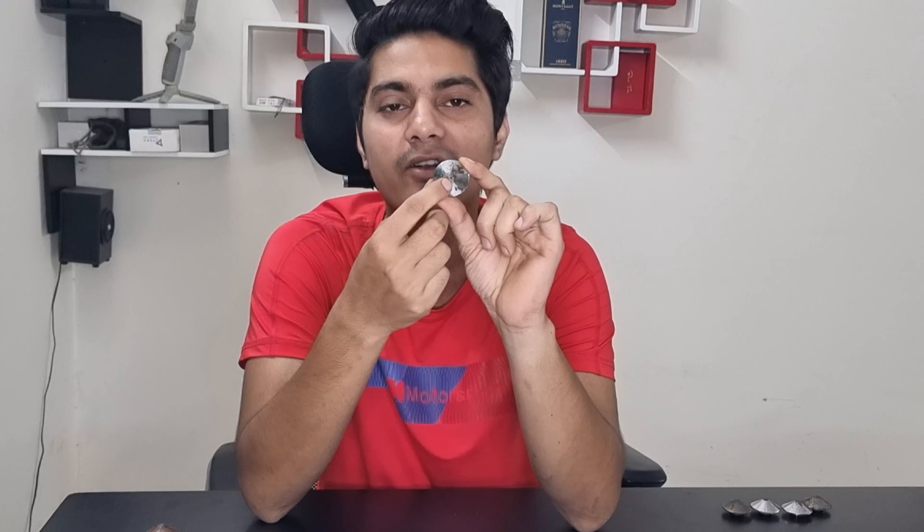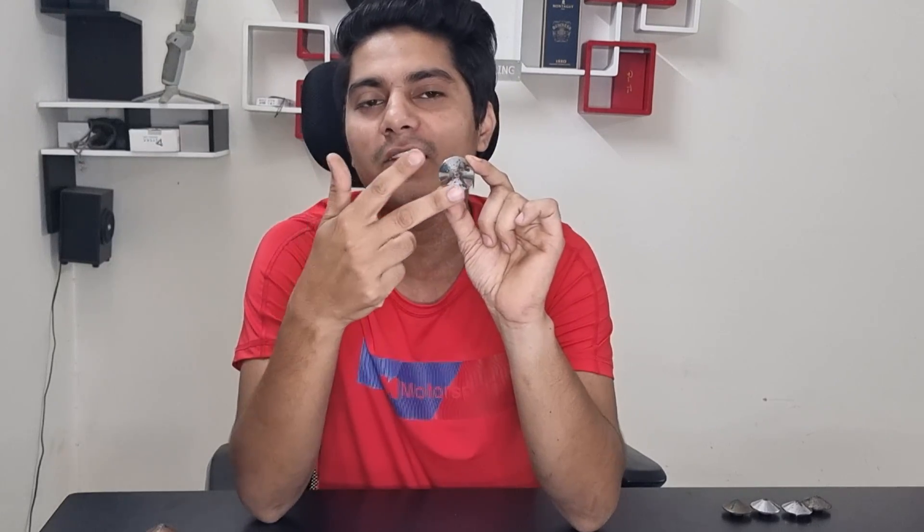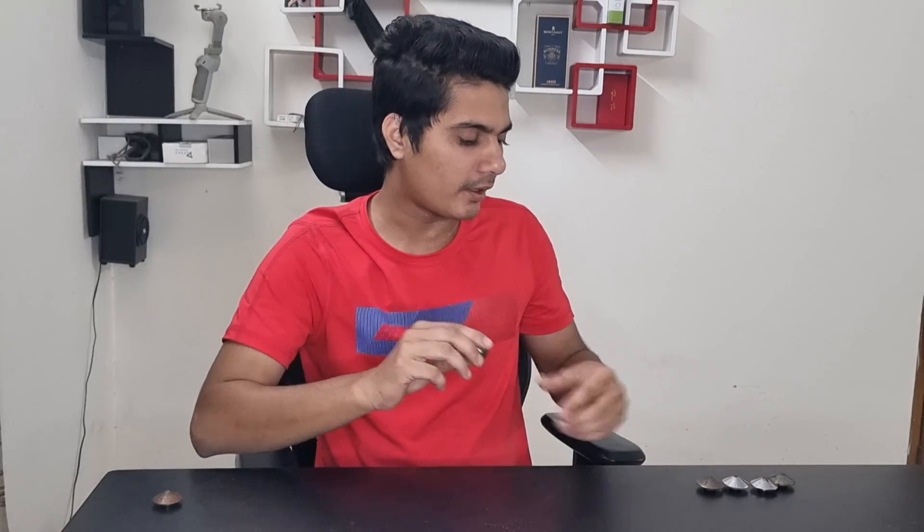The main role of a nozzle is to pass the gases and laser through its caliber. You can see a hole in the center of the nozzle — it varies from 0.8 mm to 4, 5, or 6 mm depending on the nozzle size. The gas and the laser beam pass through it, and due to that action you are able to get cutting on your metal plates.